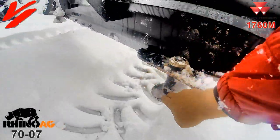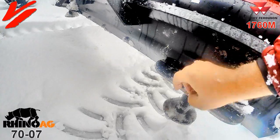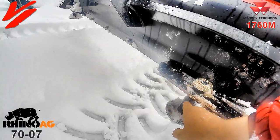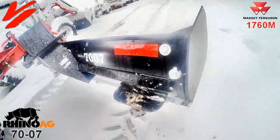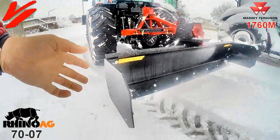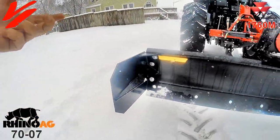One of them is skid shoes. If we look down here, you can see the skid shoe. You've got different bushings that you can adjust the height with — these washers and bushings — and there are other ones down below that set your height that you want to blade. So if you're blading on rocky surfaces, you don't have to skim all the way down to the bottom and take all the snow away.